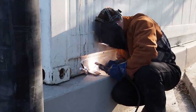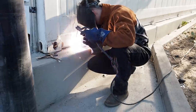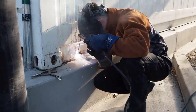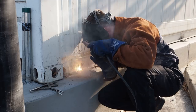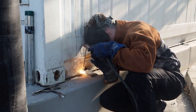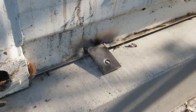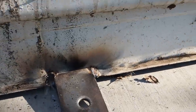I'm going to weld a fillet bead right along the edge of the side, curling around a little on the corner and towards the back. It's about one-inch side welds on that thin lip on the bottom of the container. This is just to keep the container from scooting if a forklift hits it, or from getting off the slab – and it secures it down just in case there was a mass robbery with a giant truck trying to rip it out.